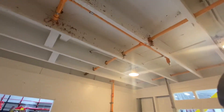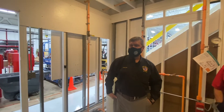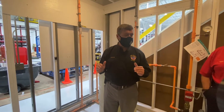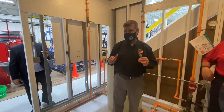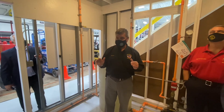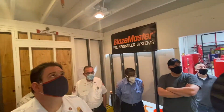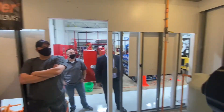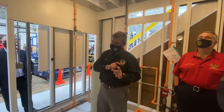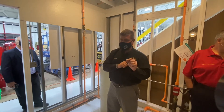What size space do you think this is — 6 by 10? Let's just say 9 by 12. If we put one sprinkler in here, what is the spacing we should select in the hydraulic calculations for a 9 by 12 room? We would select the 12 by 12 spacing. We couldn't select 10 by 10 because 10 by 10 isn't going to reach all the way across. So if we're putting one head in here, you'd be looking at the cut sheet for 12 by 12. You could pick 14 by 14 — that would be okay. But you should be calculating at least the 12 by 12 number on the form.